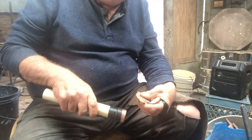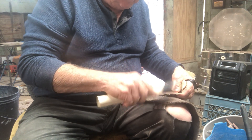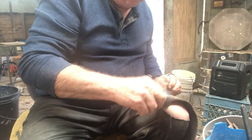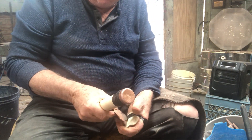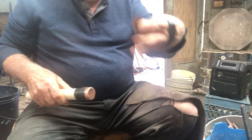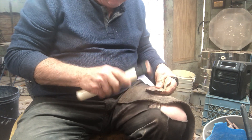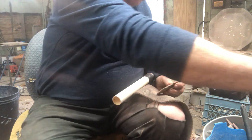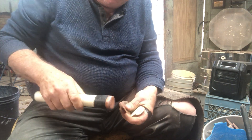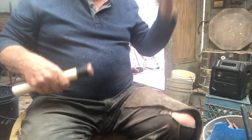Right now I'm going to come in here and lightly tap to get rid of the turtleback hump on the other side, raise this up right in here, turn it over to look at it, make sure everything's looking good, and grind it. Take the bone anvil, come right in here — nice one, three quarters of the way across. Another one three quarters of the way across. I eased off near the point so I didn't have to travel as far and wasn't hitting as hard. Like right here at the end — that's a nice one, another nice one.